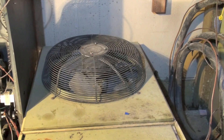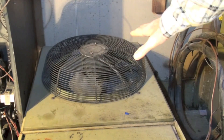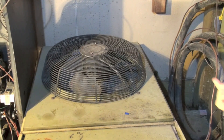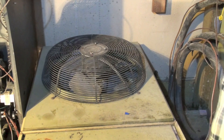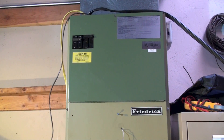If I take and lower the temperature of the air — like I'm looking at this coil here, this is a flat coil, I'm drawing air from underneath and up through it — if I draw 40-degree air through that and I change the temperature of that air by 10 degrees, I have moved BTUs from the air that's moving through it. So I'm going to take those BTUs and take them inside.